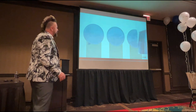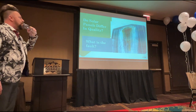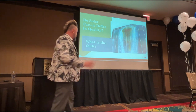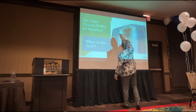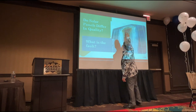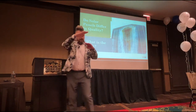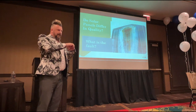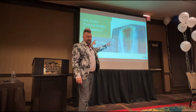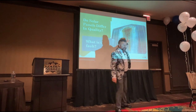There you go, covered the whole slide, yeah. What do we think has happened here? You said water getting inside. Yeah. So water's got inside. Okay. I can't reach because I'm only a midget. But if you've got a straight edge and you run it from this corner up to the top of the picture there, you would see that where that browning is, it's not a straight line. The frame has lifted very slightly away from the actual panel. Okay? So the seal has been broken. That's allowed water to get in there then. It's likely to be condensation, to be honest, because if that's on an angle pointing downhill, which we can see it is from the drip marks, highly likely the condensation has got in behind that seal.